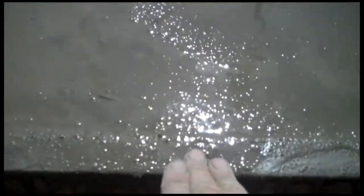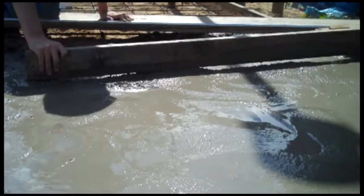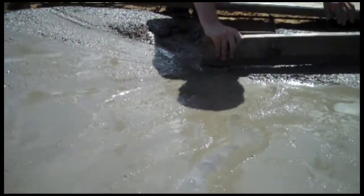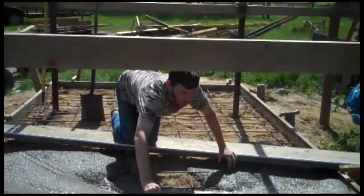All we're doing is laying it across these forms, going to the drain that's set about an inch and a half below, and that's going to make our slope so all the water will run in. We're still working with the trowel a little bit — nothing fancy. It is a cutting room, so it's not going to have tile on it, but they're doing a good job.